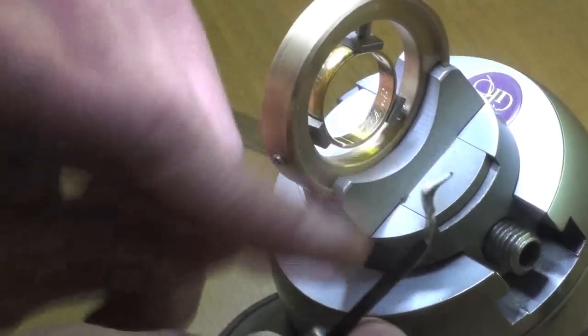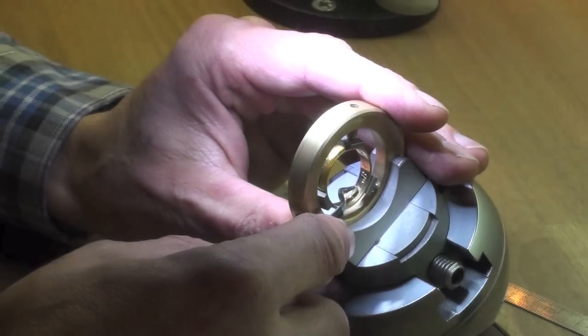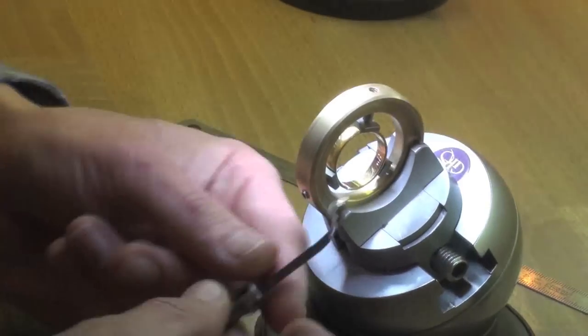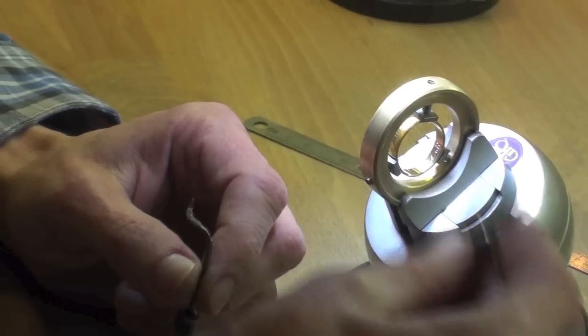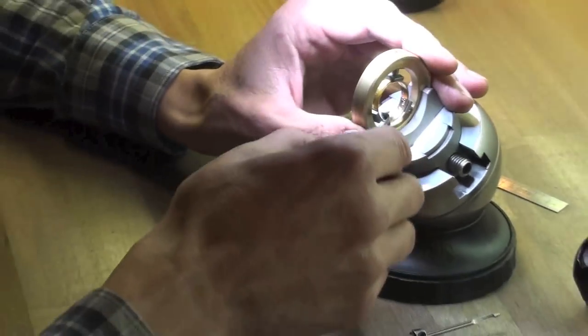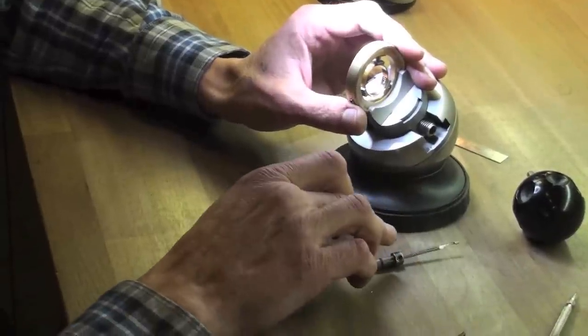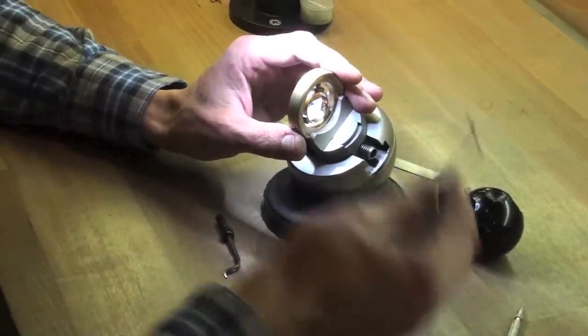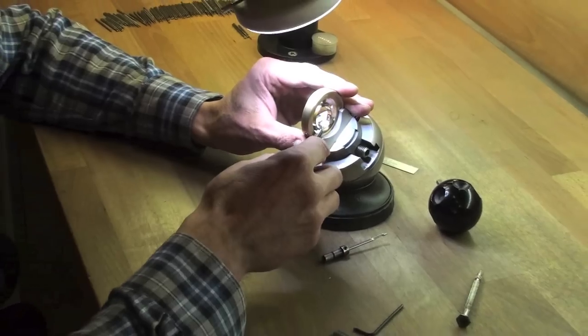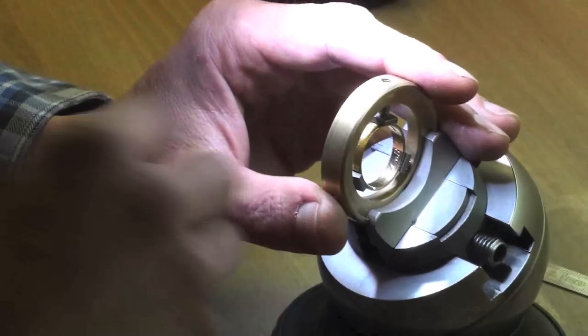Because of the curved shape of these auxiliary gravers there is much more maneuverability. However, because the position of the graver is offset from the cutting point, there is less strength. So these two gravers are used where we can't reach with the main graver — one for the left side and one for the right side.